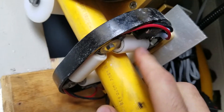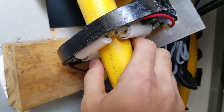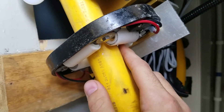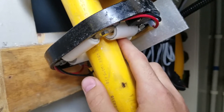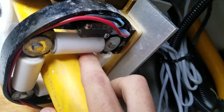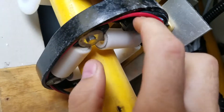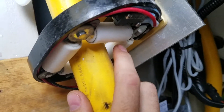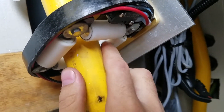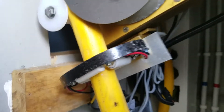These two limit switches create an interlock when the cable is running out. If both of them get triggered, since the circuit is in parallel, that will cause the unit to stop, sensing that something's binding up — as you can see with the micro switch getting clicked. Since they're in parallel, if one gets triggered that won't interrupt the circuit, but if both get triggered at the same time, since it's a bind, that stops it.